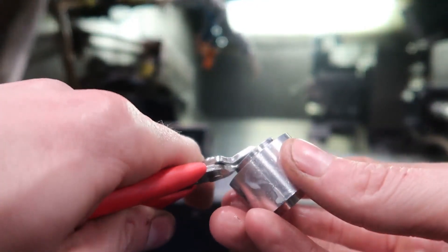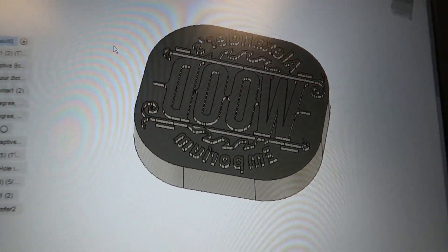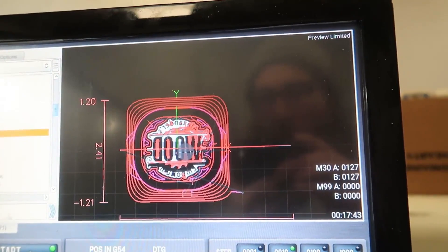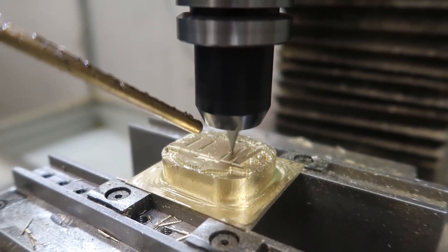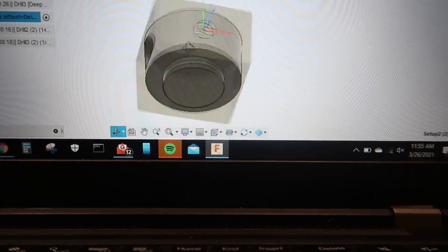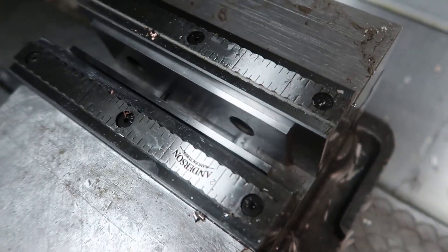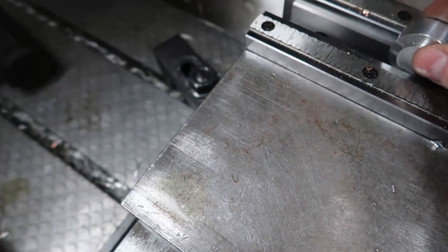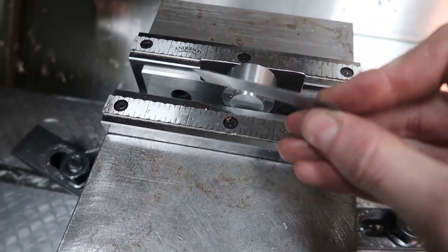Sorry, this is out of frame here — I'm just cutting out a blank for a part I'm going to put in the middle. This was over the course of a couple of days, so you'll see some branding irons first and then we'll come back to this part. Now back to this round part: there's a half-inch hole through the center, and then perpendicular to that is a 5/16-18 threaded hole. I'm not really sure what it's for — some kind of connector on a pump, maybe like a well pump. A farmer came to us and asked if we could do it.